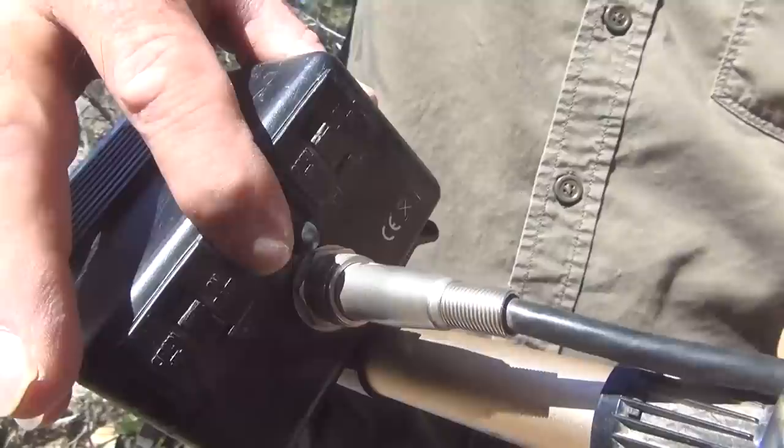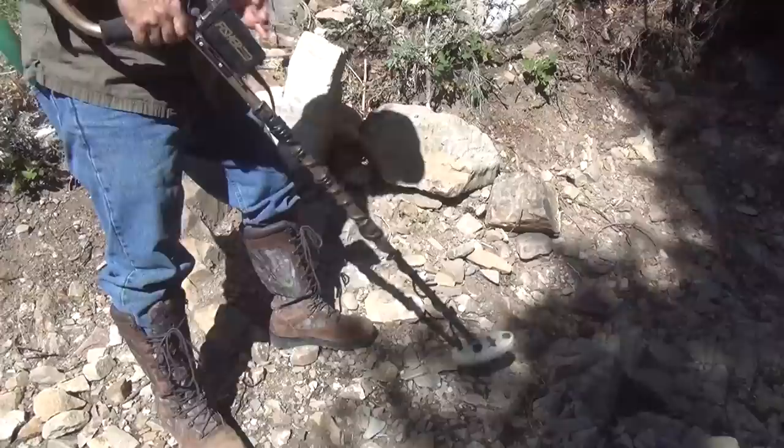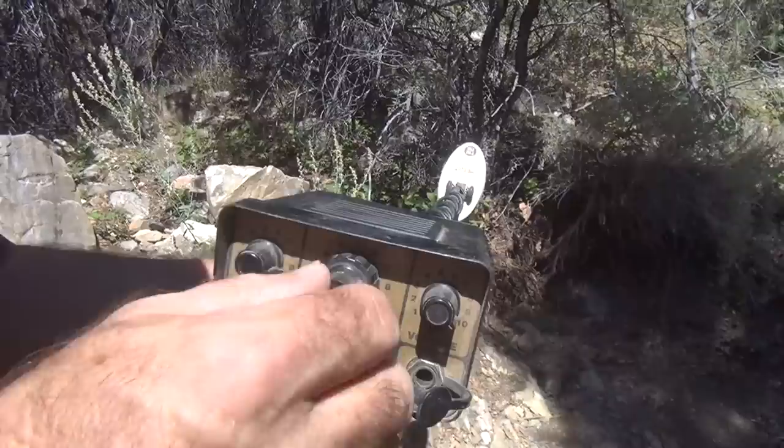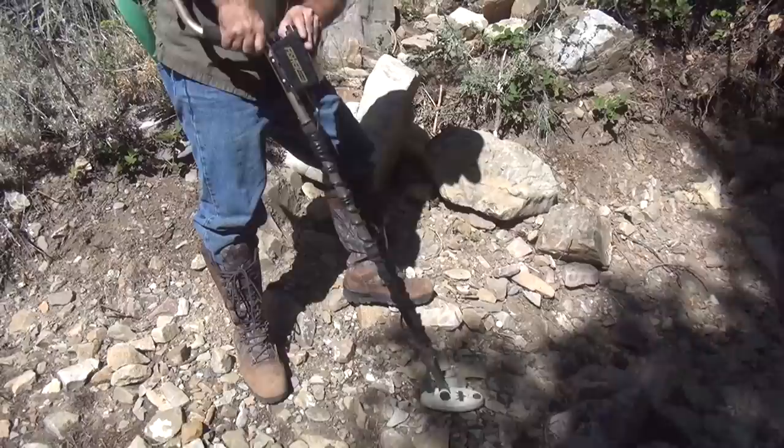First thing you need to do, son, is ground balance. I like to ground balance mine a little hot. What does that mean? Well, I'm glad you asked. As the detector's going down, it should sound off just a little, not a lot. Now, when I do my adjustments, I'm adjusting this big knob in increments of 1. The little knob, clicking, increments of 10. I'm not that far off, so I'll do increments of 1. I'm rolling it with my thumb as I'm pumping the coil.